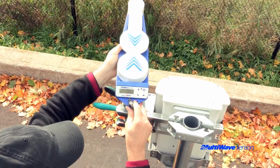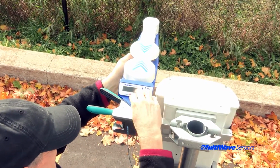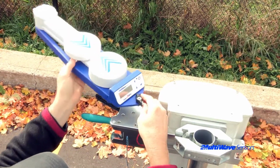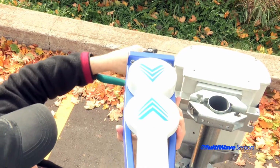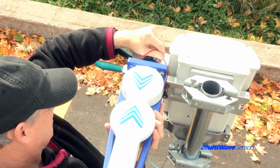If the antenna has no obstacles in front, which could prevent a forward orientation, and the antenna is not live, the forward position is preferred. If there is an obstacle in front of the antenna or the antenna is live, the side orientation is preferred. If the antenna is live and either side has obstacles, then use the backwards mounting orientation as space permits.